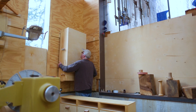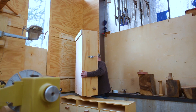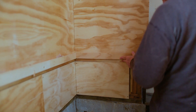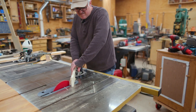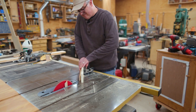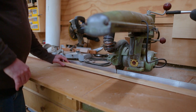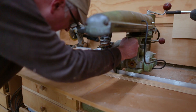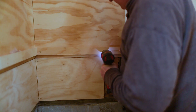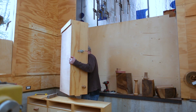I stopped moving the floor cabinet at this point and had to move the cabinet on the wall. In moving it over to that wall, there's a little strip of French cleat that isn't installed yet, so I needed to make that little piece. This isn't going to be there to hang anything on — it's just a spacer for the cabinet so that the cabinet hangs vertically. So I just need to make the little foot and a half or so needed in that corner. Then the wall cabinet can be put in place.